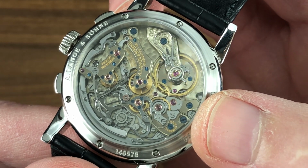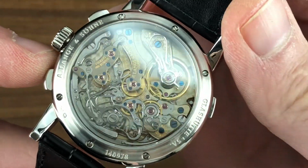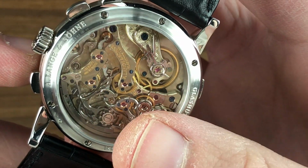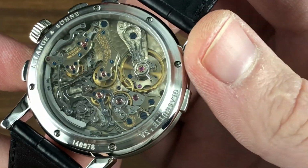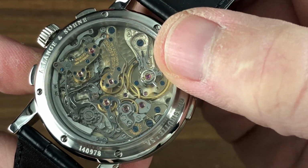And you'll appreciate that the watch does include instantaneous jumping minutes and a lovely set of recentering hammers that reset everything at the push of the reset trigger. Of course, there are mirrored bevels on the edge of the steel chronograph lever, yoke, and recentering hammers, as well as the edges of the German silver bridges, and an engine-turned perlage across the base plate with a hand-engraved balance cock. You can see that freehand engraved half bridge.